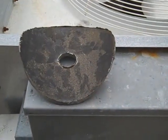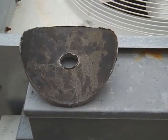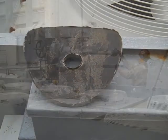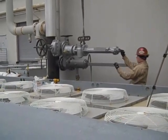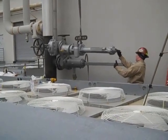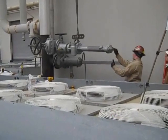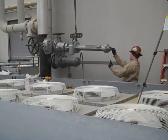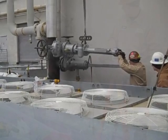This is the return coupon that was taken out. The inside of the pipe looks fairly clean, and that'll obviously help with the line stop sealing when it's installed. They're attaching the drill rig on the supply side now, and we'll do the same as they did on the return — mount it to the valve, penetrate the pipe, valve that off, remove the drill rig, and put the line stop apparatus on this side.